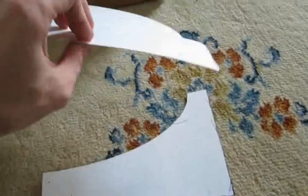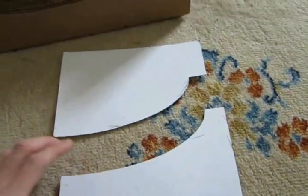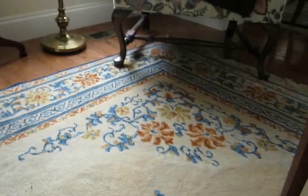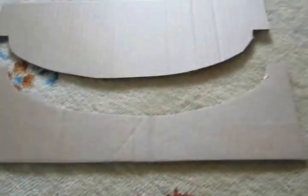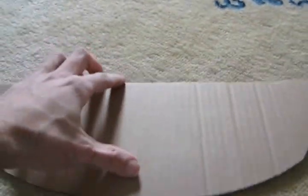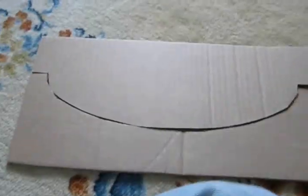I made a template, split it in half so it fits on harder cardstock paper. Cut a couple out because these got pretty ratty from tracing. Then take your cardboard after you cut it down and get all the tape off — it's very important to get all the tape off. And you make a positive and a negative of your mold: the bottom piece and the top piece, and they fit together like such. That gives you a slice of your press.